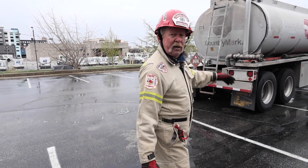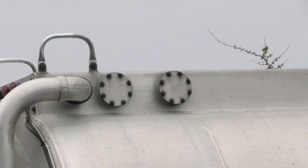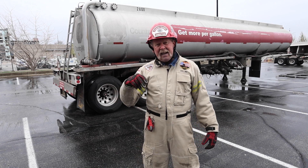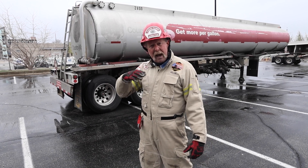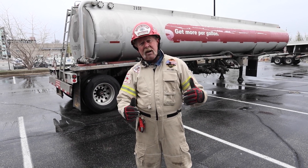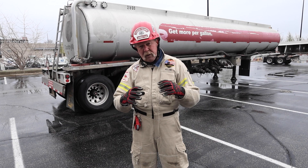As we look down the side of this tanker, up top where this vapor pipe enters that rail, you see those two discs up there. Those are a negative pressure and a positive pressure relief valve. This is a low-pressure tanker trailer, designed for 2 psi or less. If the pressure inside that tank increases above 2 psi, that relief valve will let out some vapor to keep the pressure low. On the other side, if the gasoline loaded into this tanker trailer is a warm product going out into a cold northern climate and the pressure starts to diminish, it will allow air into the tank so that the tank won't collapse — because this tank is made of single-wall aluminum.